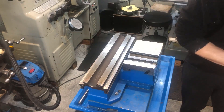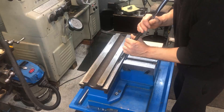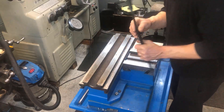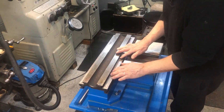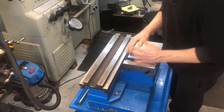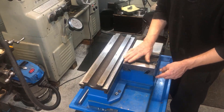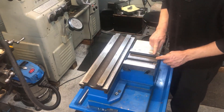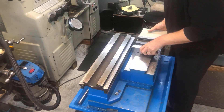I could also use the hand flaking technique, which I will show later on this one. But this one is saving time with the BIAX flaker. This would be a good example of where to flake, at least to what I have been taught. Not on top here — this I would leave as it is: ground or now finish scraped. Underneath here, another system.